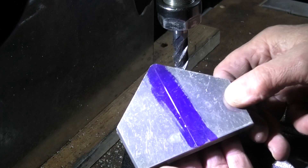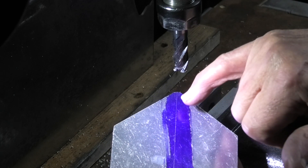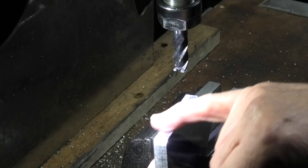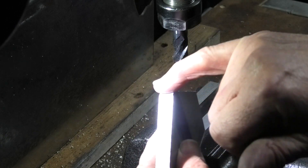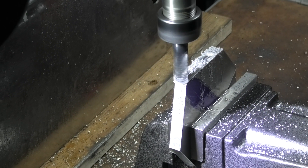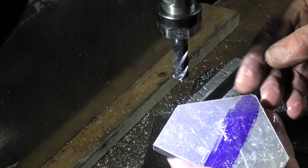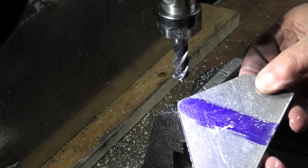What I've done now is just marked it up with some blue marking fluid and scribed the line down the centre. What I'll do is just get a better finish than a saw cut on it — take a few thou off that side, a few thou off that side, leave that rad on, and then that's ready for the drilling operation. That's just a rough shape; there's nothing special about the shape, it's just big enough to fit on my compound slide.